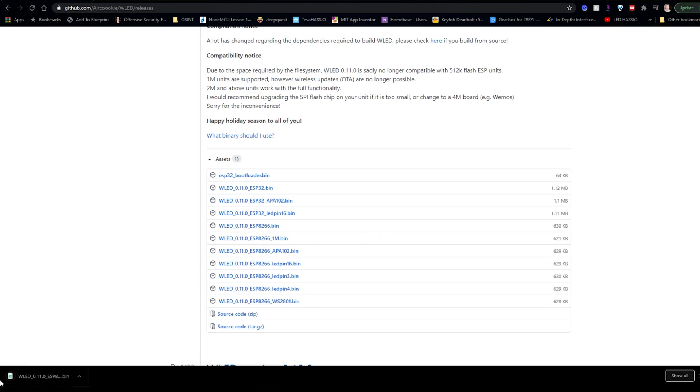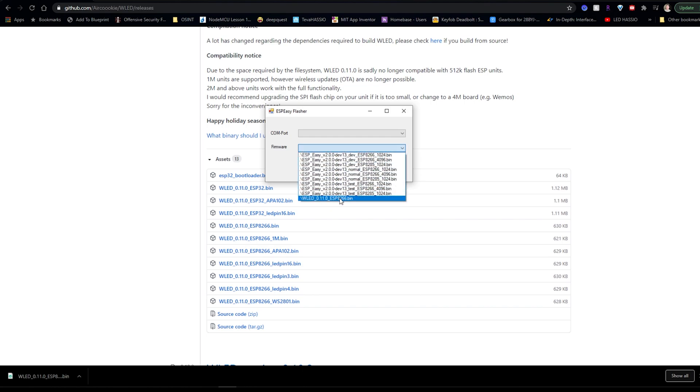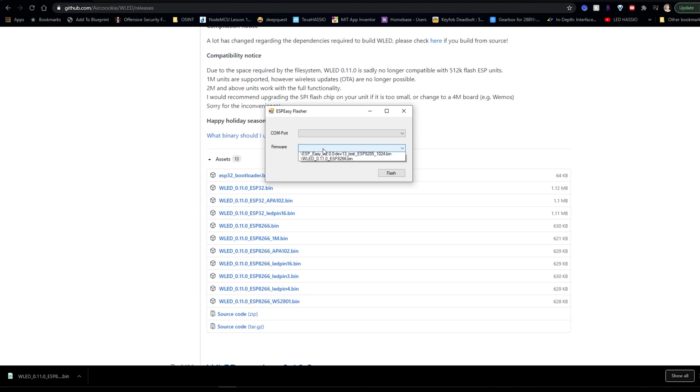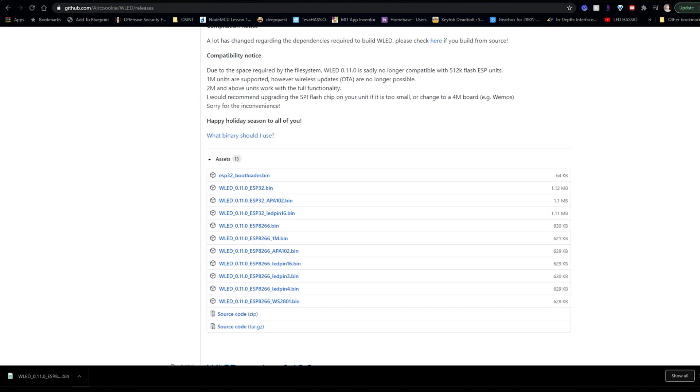Download the firmware and for this video I'm using ESP-Easy Flasher — open that up and it will show the COM port. If you have the NodeMCU connected it should show which COM port is open. Choose your bin file that you downloaded, and make sure you place the bin file into the ESP-Easy bin folder so it shows up in the firmware dropdown. Select it, hit Flash, and it will load up just like that — your NodeMCU is perfectly configured.